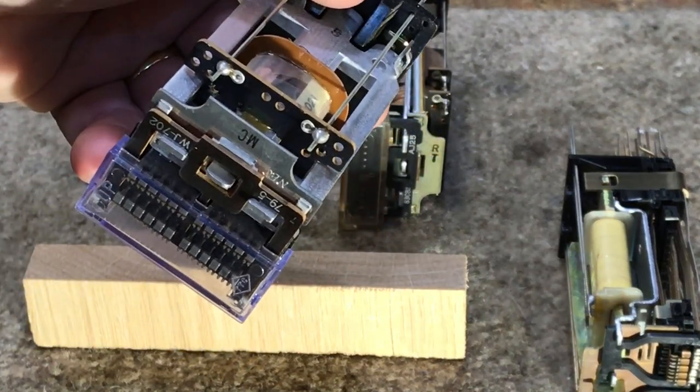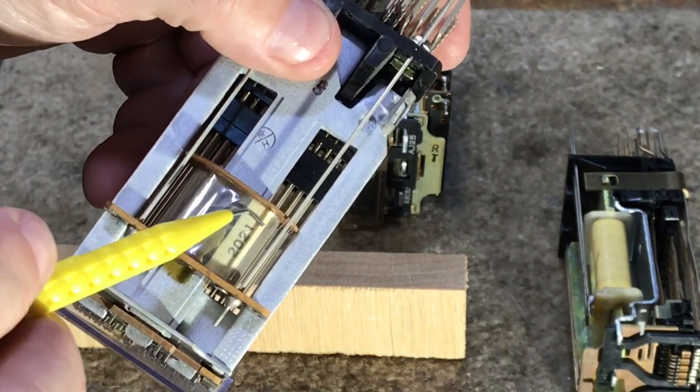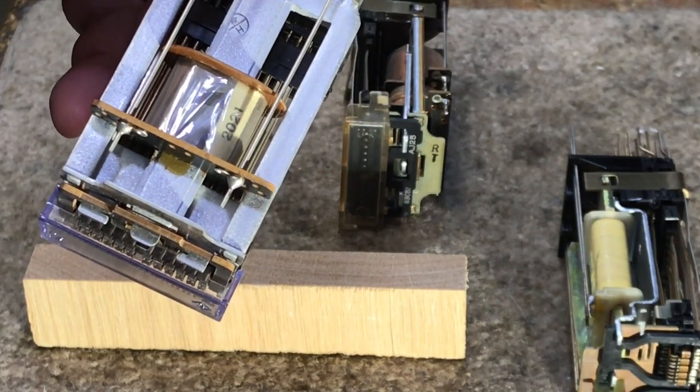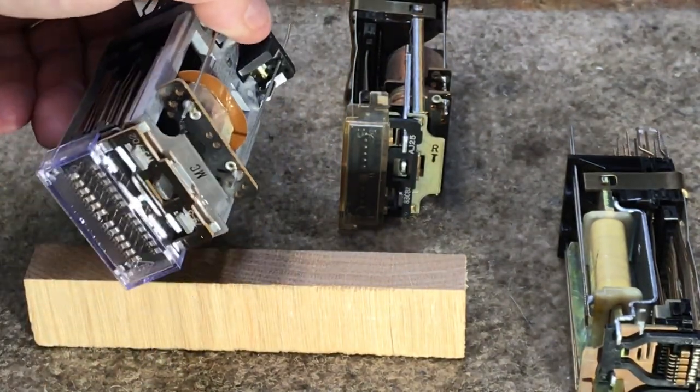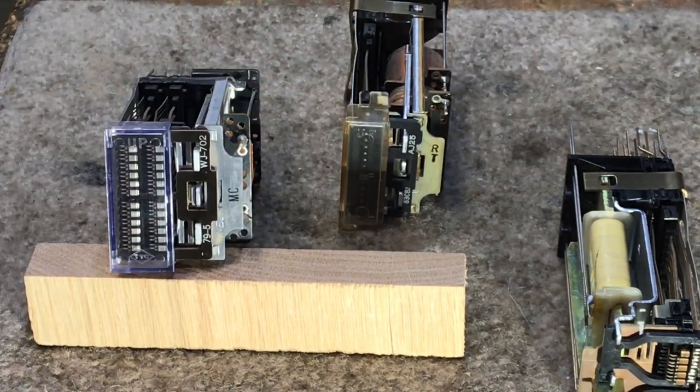This particular one was used in a marker in a Japanese PBX, has a small winding, and was intended to operate very, very fast. They made all kinds of different configurations, and this was also used where you only needed to make a whole bunch of contacts instead of transferring circuits — kind of like scanning input leads or registers.